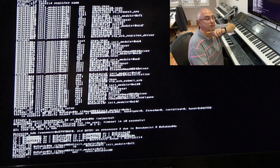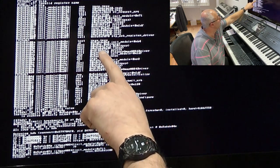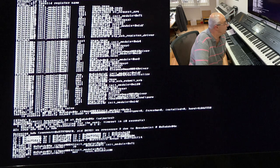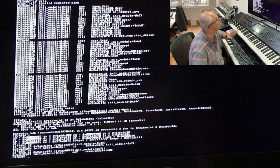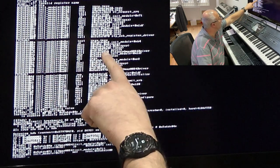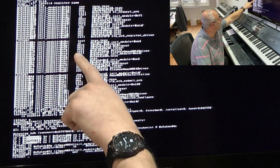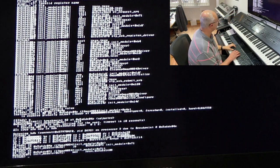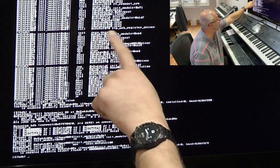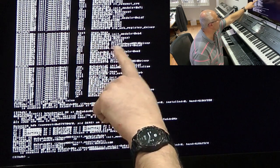Now, here is the interesting part. Notice this call. You remember we talked about earlier the STG bit, where the STG does stuff that is not really necessary or is just kind of bypassed. This is what I meant earlier on. I'll take you through this now, but I'm just going to put a breakpoint in here. So I'm going to break module at 0x8A, so now we are breaking here just in case, because I'm going to go into it and then I'll run it to break up in here to see if AX is 0 or not.